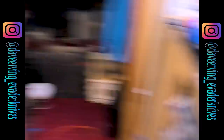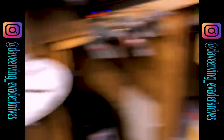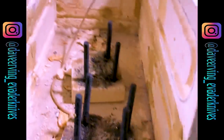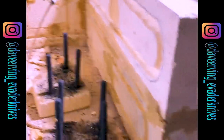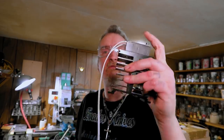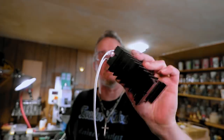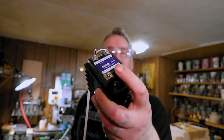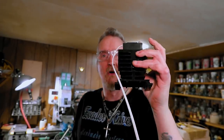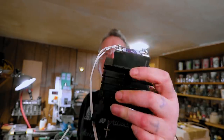The sides are done on the big oven. I just did it on the drill press with the half-inch bit. Now we just have to wait for everything to dry, then we can pull the elements and everything will be good to go. I can't find my thermal paste or the screws that hold these together. But when you put your solid-state relay on the heat sink, it has to have thermal paste in between. I got some on order.